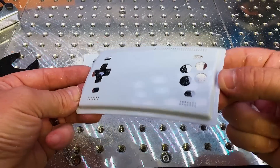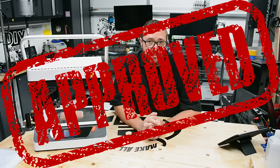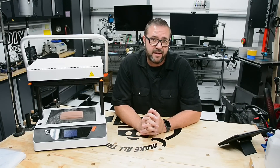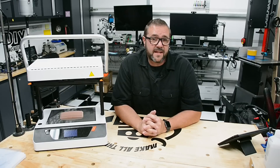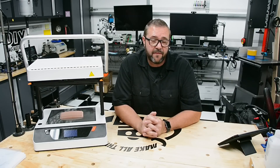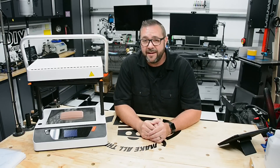The right material will be formed from a 2mm smoke gray plastic to replicate the blackout bezel of the Retro Arcade. It's on the way, but for now the process works great. In the future I'll share pics of the final bezel when the material comes in. As you can see, the vacuum form worked like a champ. It's easy to see how this machine can be leveraged for lots of unique parts that can take your projects to the next level. I hope this process was useful in seeing how parts can be thermoformed and then milled for precision applications. I'll be demonstrating more of its capabilities in upcoming videos. Additional information on the vacuum form and the materials used in this video can be found in the description below. Leave comments below, do your thing, be safe, have fun, and I'll see you next time.